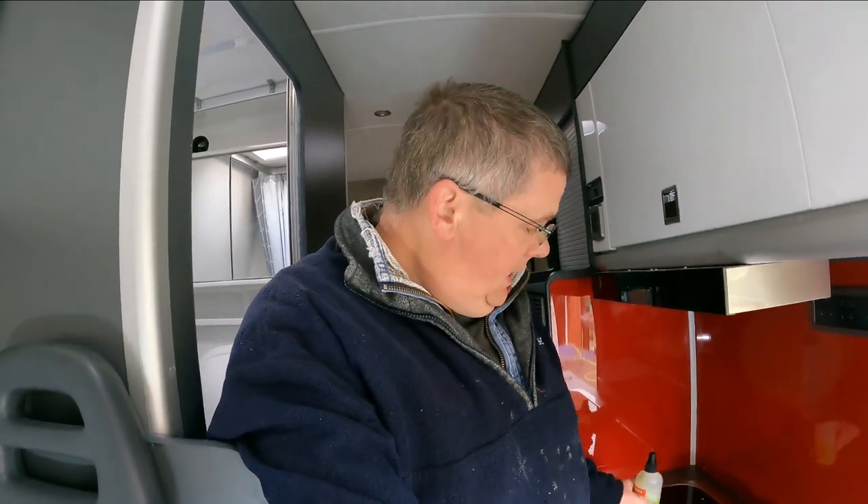So that's all you need. If you want to get yourself up and running, feel confident that you're okay gas-wise and there's no leaks — belt and braces and all that — just a bottle of this stuff. Any good plumber's merchants will sell you one of those or something very similar. And then you can get the old gas man in for a proper certificate as and when. Hope that's been useful, especially if you're at the gas stage and you're not quite sure how to go about testing that. I was going to show you the Fernox — let's go and do that.